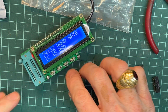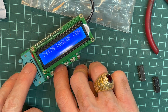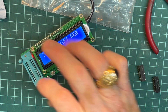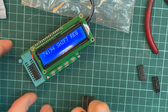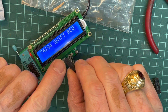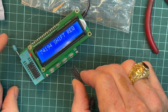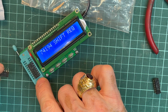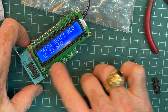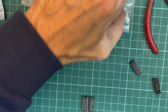Now testing 74LS194. The good thing about this tester is it's simple to use — you have a display, you put in the IC. The IC has a notch which marks pin one, and you orient the notch facing the top while seating the IC at the bottom. Hit test — this IC is totally bad. It's a shift register that's gone, we can throw it away.